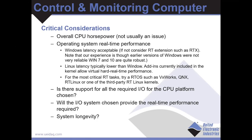So, considerations: you need to make sure that whatever computer you buy has the CPU horsepower you need. You should pay attention to the operating system. Windows is used pretty often, although if high speed and low latency is required, sometimes Windows isn't a good solution. Linux might be better. And for the most critical real-time solutions, you might want to try a real-time operating system